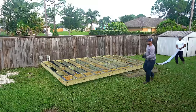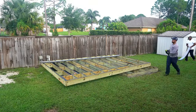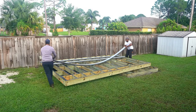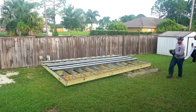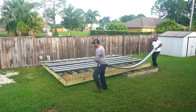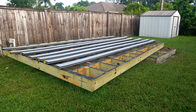In this video we're going to pick up where we left off and finish the deck. The substructure is made from 2x8 pressure treated lumber. For the decking, I'm going to be using a composite material by Trex for a number of reasons — unlike real wood, you don't have to spend days trying to upkeep it. It's very low maintenance. I designed the deck to be 16 feet and went with 16-foot decking so I didn't have to have any joints.